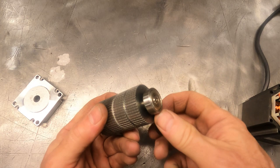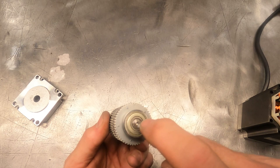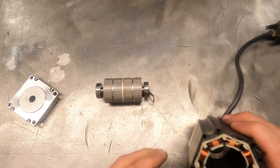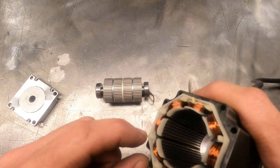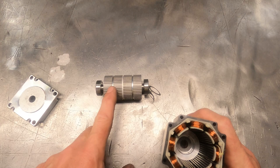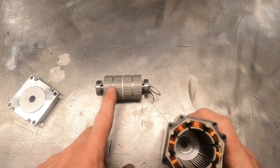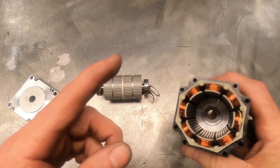There's a little spring washer on the bottom and a bearing on the other end. The armature is just stuck - probably neodymium or rare earth magnets. Here's the actual shaft. We're going to see if we can press it out. The motor is no good as-is, so it can't hurt to try. Here's the inside of the stepper motor - all it is is coils, very similar to any other motor except these coils engage and disengage in tiny steps. The armature is a magnet - there's no commutator, no electrical connection between the armature and the housing.